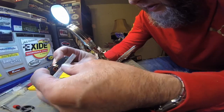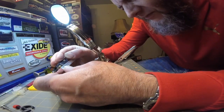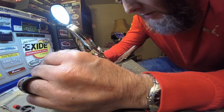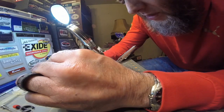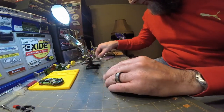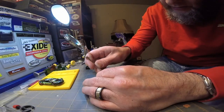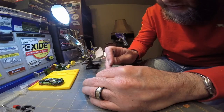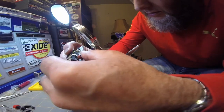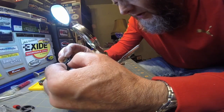And that looks like we're pretty good now. Both of them look pretty flat, and there's not much. This one looks like it still might be a tad up in the very, very front of the pickup shoe. So to solve that issue, we're going to take and tweak it just a skosh that way. And we're going to look like we're pretty good there. So that looks fairly decent.